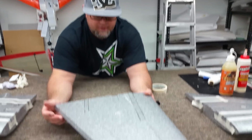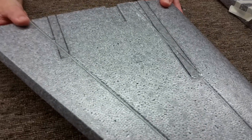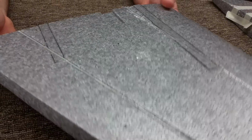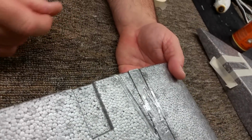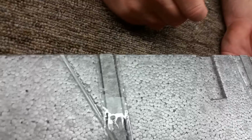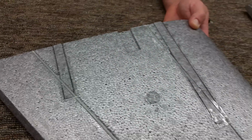As this goop cures, the goop will, again, like I said, take these small gaps and pull them closed, and it will fill that area with goop, so you don't have to worry about these spar caps not having adhesive in the cracks of them. I know when we glued them in, we put adhesive in the crack and pushed it all in. I'm just filling up any minute gap that might be left over and giving it some more strength to hold these spar caps in.